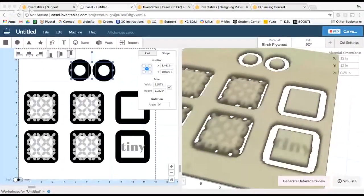So what does that mean? So this shape that I carved out is the diamond piece that I did. I just carved 2 of these little diamond pieces, and then once I had them, I just glued them back to back, and that's how I got my little knob on there. So that's kind of a neat trick, is you don't actually have to do any centering with the knob. You just have to make the shape twice.